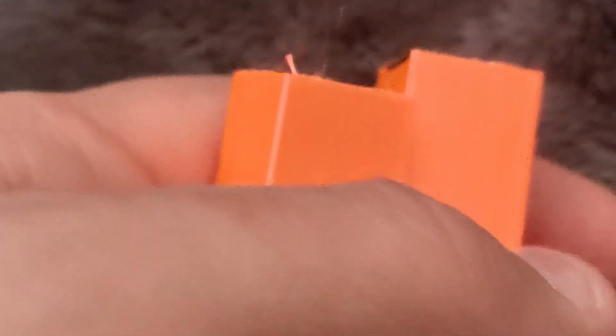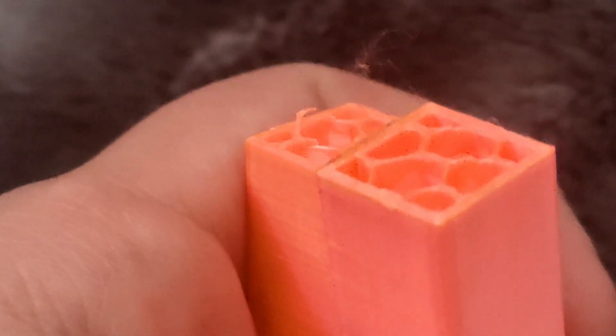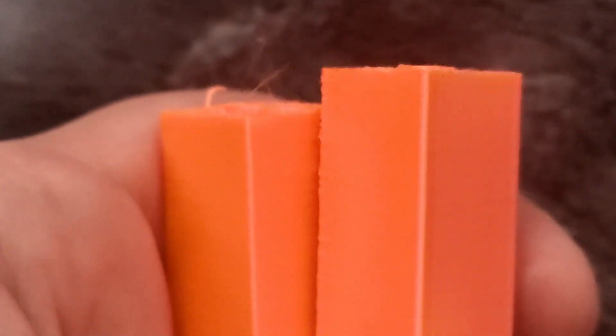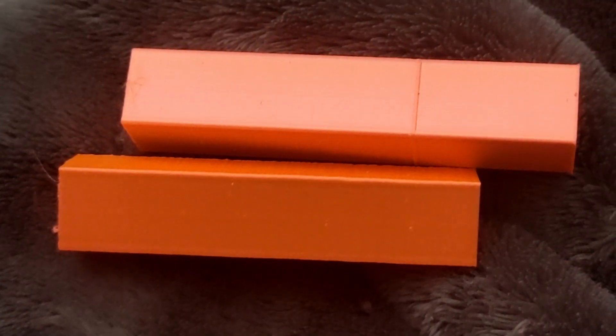Not so good when you change filament. However, if you pause it quickly and change filament, the less heat that's going to be lost the better it's going to bind together. It just feels like when it resumes the print it purposely puts down a thicker first layer to make it bind more, which is why it's bubbled out a little bit. So while the finish isn't going to be perfect, it's nice and strong if you do have a power failure. When changing filament, not so much - you've got to try and do that as quick as you can. But yeah, that is how you do both and there are the results. Thanks a lot for watching - drop us a like, comment and subscribe.